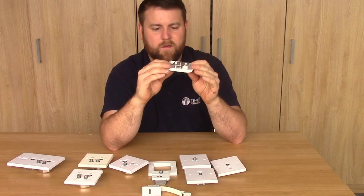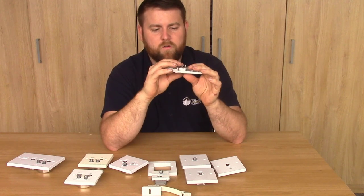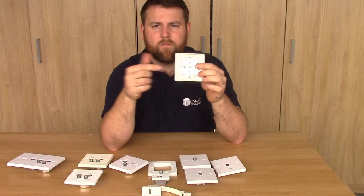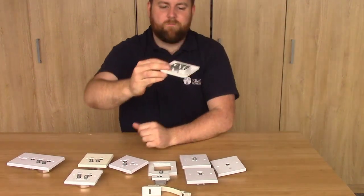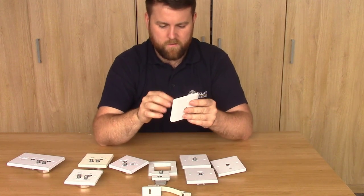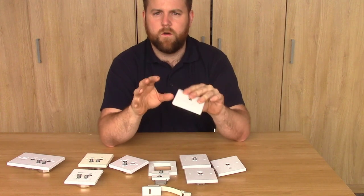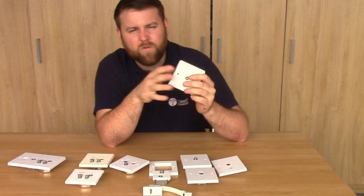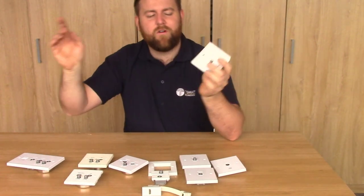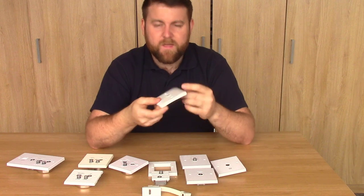This is also designed for a loop wire. If you look, it's got two sets of connections going in. And this is a load of rubbish - you never want a loop wire system. It won't match 75 ohms. You should never ever loop wire a system; it won't work properly. It's very common with electricians - they loop wire sockets and stuff like that. But you can't do it with a TV aerial. It won't work.